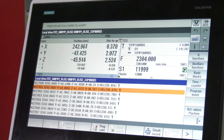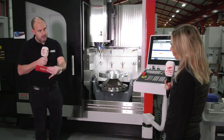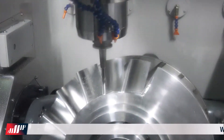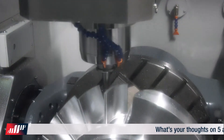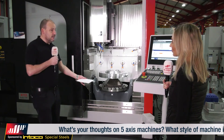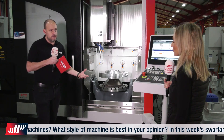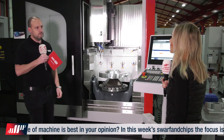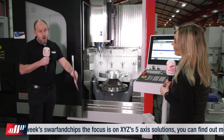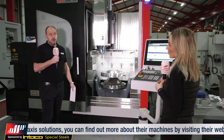There's also the spindle options: 12K, 15K, 18K, or 24K RPM. High-speed toolmaking and high-speed surfacing want a high-speed spindle, but you might need something lower in speed but higher in torque. There are also options for through spindle coolant at 20 bar or 70 bar, and linear scales — this machine comes standard with linear scales, to complement everything we're talking about in maintaining accuracy. You can also add probing, and there's the choice between either the Siemens or the Heidenhain control. Those choices are laid out for people to spec whatever works for them.